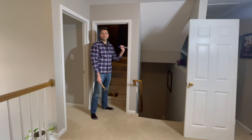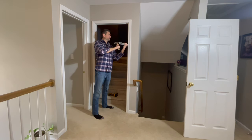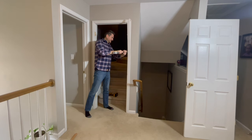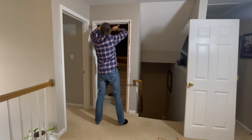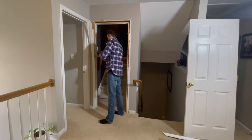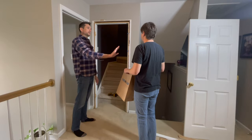Now that I've trimmed the caulk, I'm going to tear this apart — this is where your house starts falling apart. This part is just delicate brute force. I'm hammering in a small thin pry bar between the casing and the door jamb and prying the casing loose. It's just held in place by brad nails and caulk. See that brown spot at the top of the door on the drywall? That's why I didn't slice the caulk well enough — I got a paper tear.